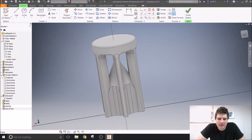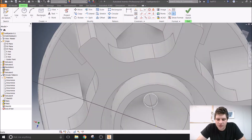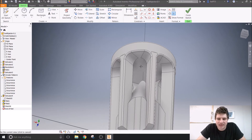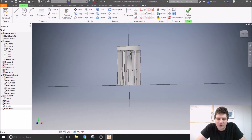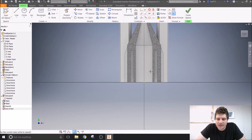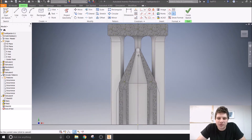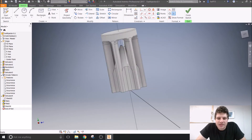This is my first design. The idea is there's a nozzle here aiming at a solid wall. When the fuel goes through the nozzle, it'll hit this wall and splash, and I'm hoping that'll be enough to vaporize or atomize it. I'm not working with super high pressures and I don't have a way of machining a really fine spray nozzle, so I'm hoping this will work. If you look at the cross-section, you can see what it looks like on the inside. The cross-sectional flow area slowly decreases, which means the velocity of the fluid increases, hitting the wall and splattering — hopefully without catching everything on fire. I'll go ahead and 3D print this and we'll see how it turns out.